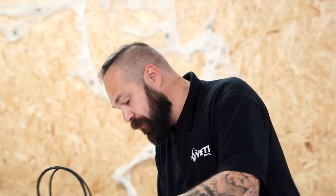So that is the first tool path finished. So that was our V-carve cutting on the vectors now to create the detail. I'm really happy with how that came out, and it only took 13 minutes to run that whole file. So I'm gonna go ahead now, change the spindle, and we'll get straight into the second toolpath.